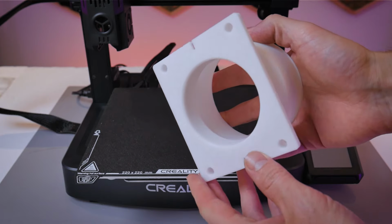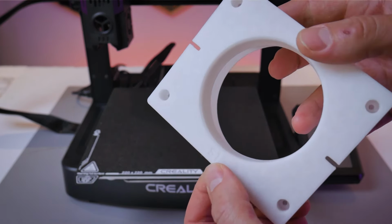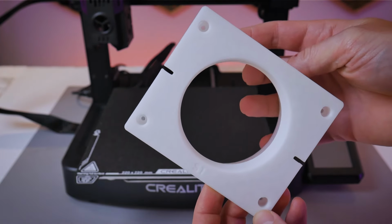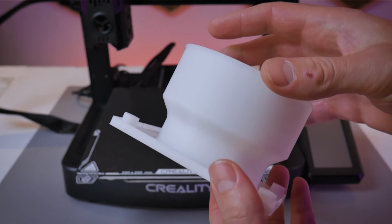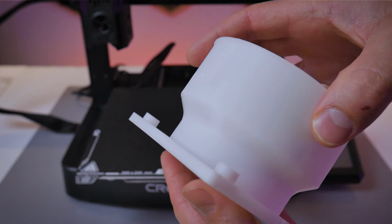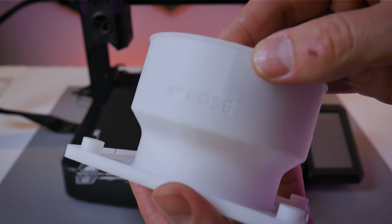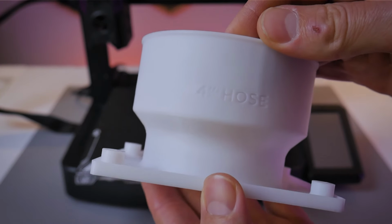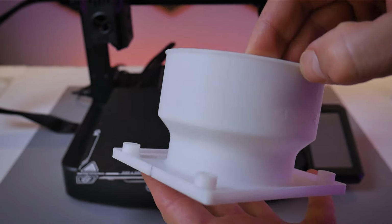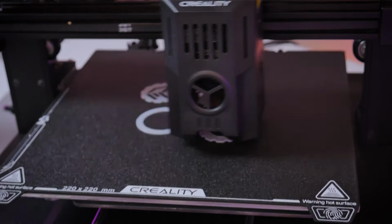Despite the first layer being laid down a touch too close to the print bed, you can see the bottom of the print still looks nice, and the KE comes with a textured flex plate, so you can see that texture was transferred to the print. Again, looks very nice. There's very minor elephant's foot on this part because of that close first layer. The round surface looks very clean. There's no waviness or signs of Z banding. You can see I'm pointing out the seam, which falls to the left of that letter E. And speaking of lettering, those came out looking clean. Overall, a very nice part.